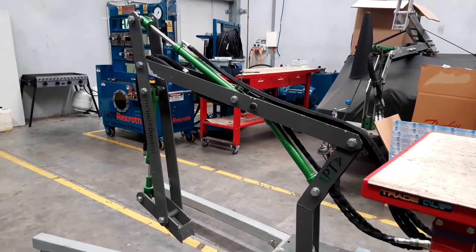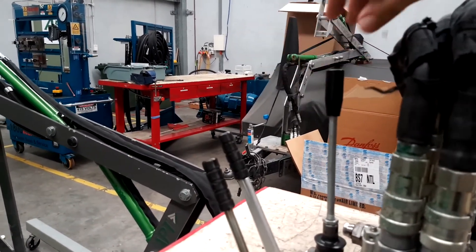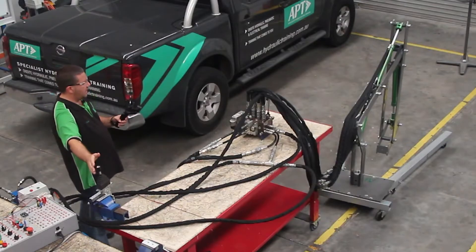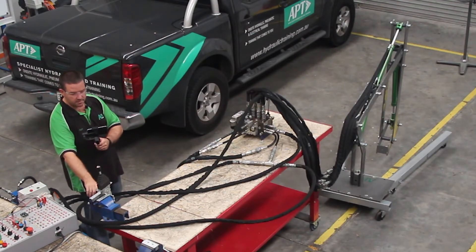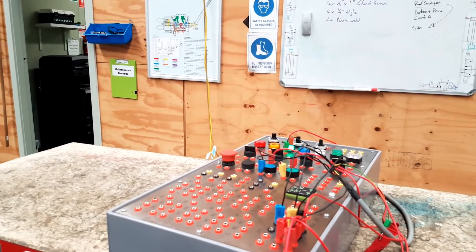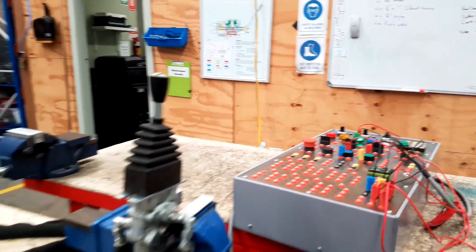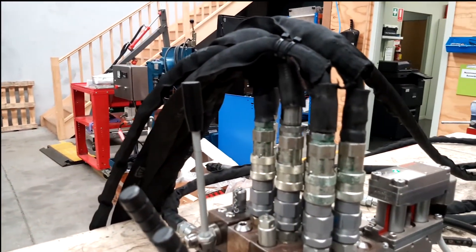As our machines have developed, we've gone from manual lever operation — where oil came from the valve bank straight out the hoses — to using a joystick, which reduces operator input and also exposes the operator to a lower pressure in the cab: the joystick might be at 50 bar whereas the system might be at 350 bar. We've also progressed to electric controls, so operators only have 24-volt electricity near them, which is very safe. But the downside is that with no hydraulic pressure running and the pump not running, these spools don't actually do anything when we operate our remote control systems.